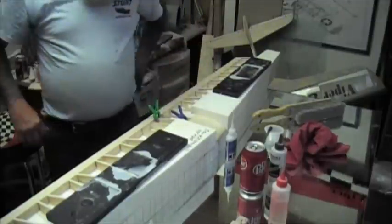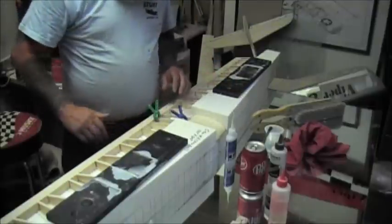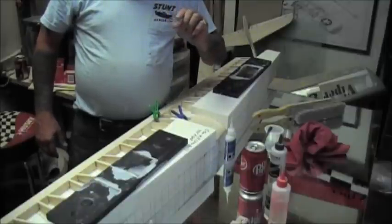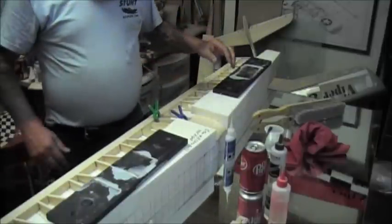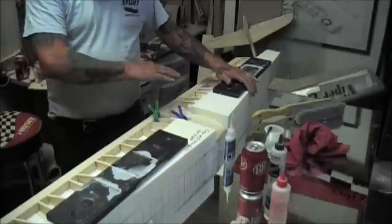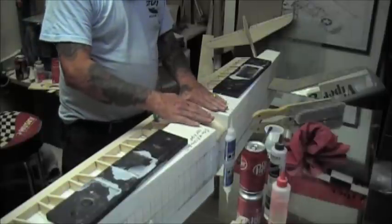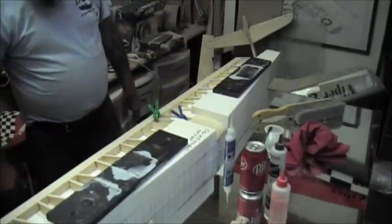After the wing has the center sheeting in there and the compression spar and the bell crank mounted, I'll go ahead and run a 3/4 inch piece of fiberglass over the center section, or you can use the carbon veil several times over the center and then overlap the silk span with one run this side and the other run that side, so you get a double layer in the center. But you want to make sure that you get this center joint nice and solid.